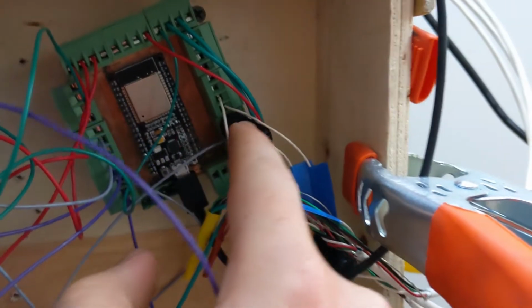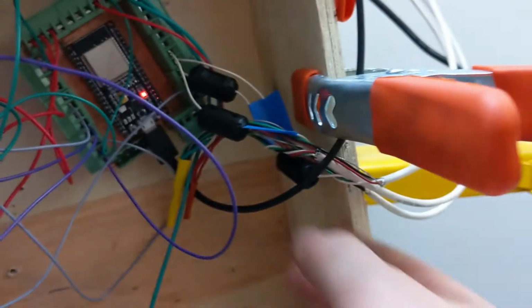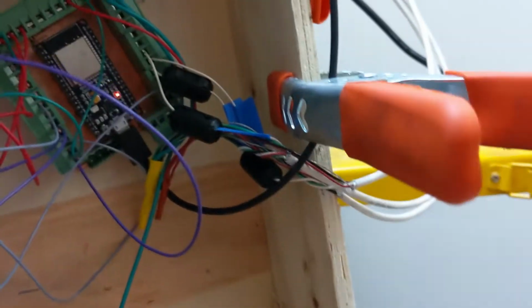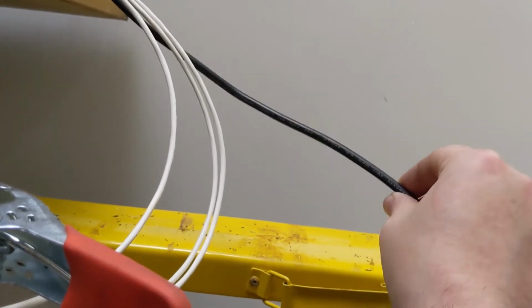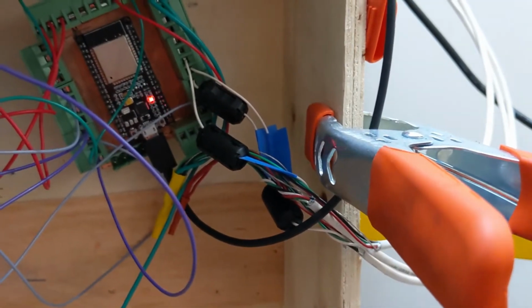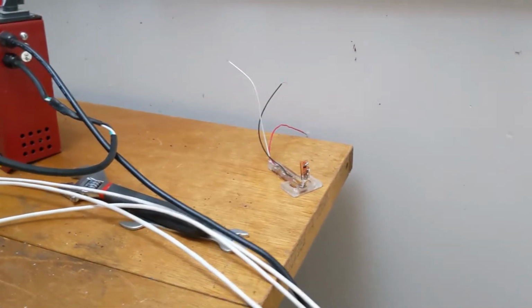So, I'm not really sure what the right thing to do is. This board I made has these terminal blocks, and there's no RC filters or anything on these limit pins. I put these chokes on just to try to troubleshoot it a little bit. I think that even though this is off, this wire is the culprit. Which is, if you don't know what you're doing, which generally I don't, that can make it extremely hard to troubleshoot.